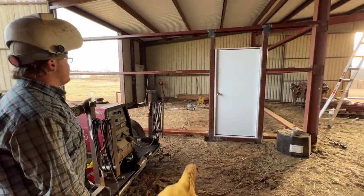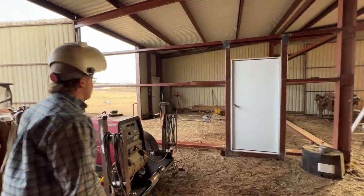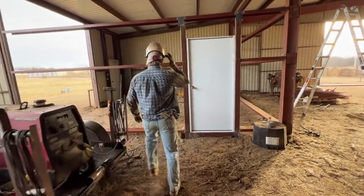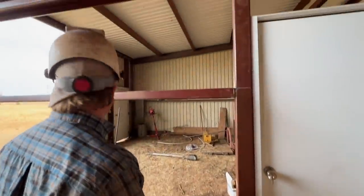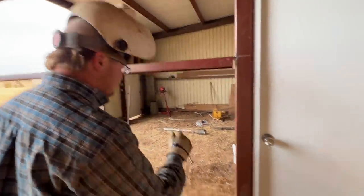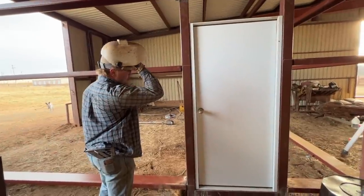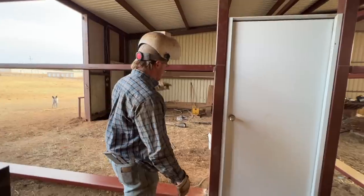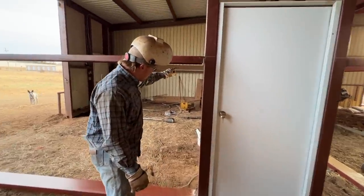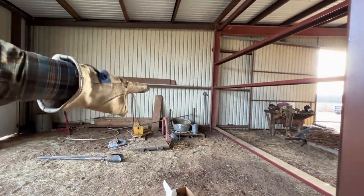And why did we, what are the spaces? Explain the spaces. Are you talking about the spaces between the purlins? Yep. Usually you want to make them even. You want to go 4 foot, 4 foot, 4 foot, all the way up, starting from the bottom. But in this instance, we have a pre-existing purlin on the pre-existing structure at 5 foot. You can see right about there.